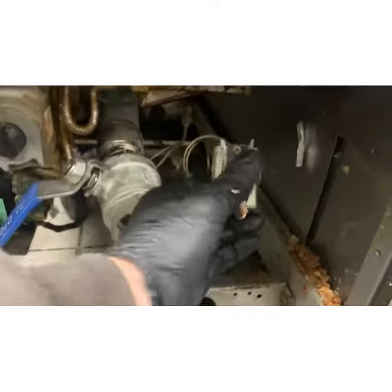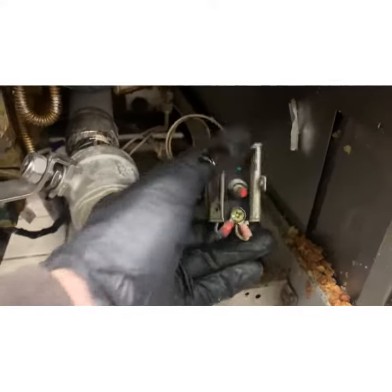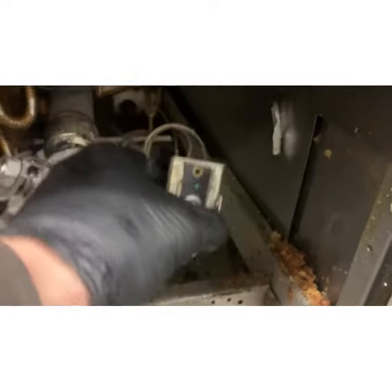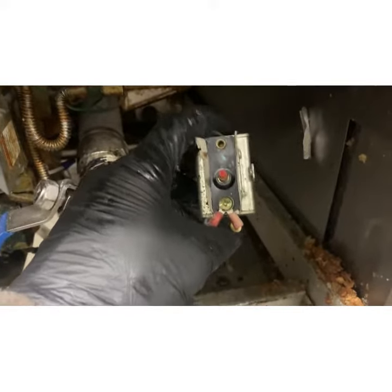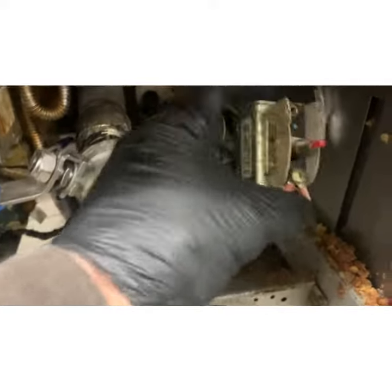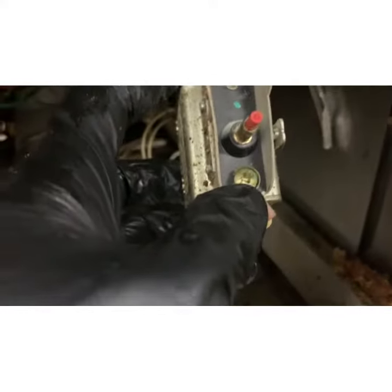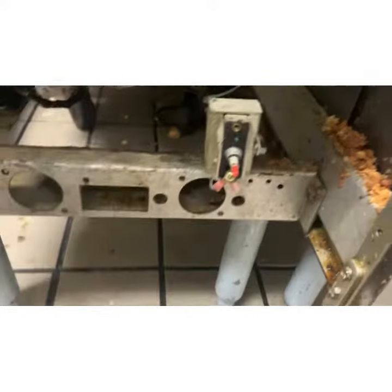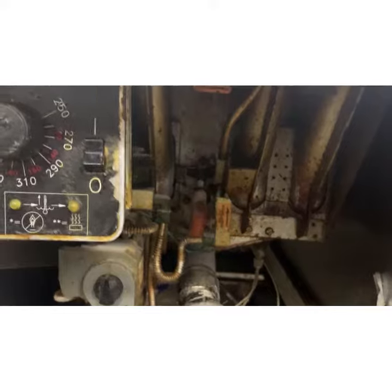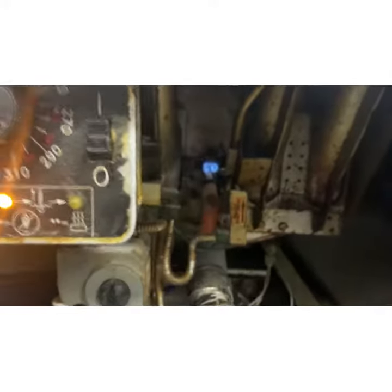Okay, so for testing purposes only — I just cannot leave it to run this way. For diagnostic purposes, I'm condemning the high temperature cutout. So what I've done is jumped it — I put the two wires on the same side, so this is now irrelevant. If that diagnosis is correct and when I fire this up, it's going to enable it to light.